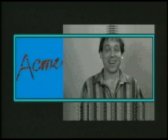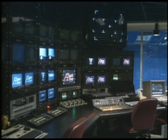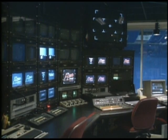Big as it is, the Jumbotron only displays the center one-third of its video input. Live pictures from the cameras are framed with the Jumbo's display area in mind. Logos can be shrunk to one-third size to fit with a half-sized crop picture, or three normal video frames can be shrunk and displayed side by side. A safe area generator in the control room generates white reference marks on the control room monitors to guide the positioning of the pictures before they're sent to Jumbo.